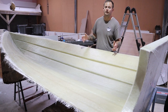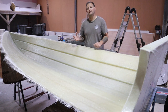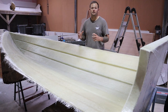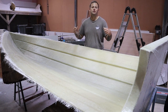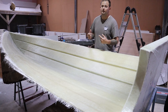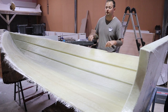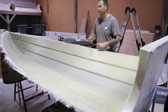Number two, you've got the composite boards that you see in some of our other builds, which is the Thermahex, the honeycomb lightweight plastic boards with the cotton sheathing on top that soaks in the mat and becomes a hard rigid board. They're great, they're lightweight, they're no good for fixing into, so you cannot drive screws through them. Well, you can, but it's not going to last too long because the only thing that's holding that screw in is the glass. There's no structure, there's no density, there's no stability in that product.